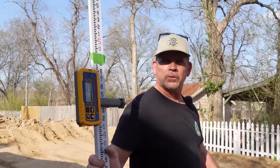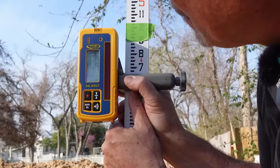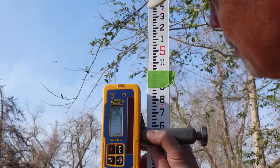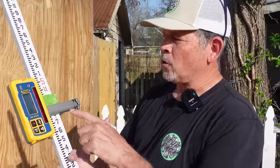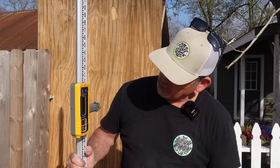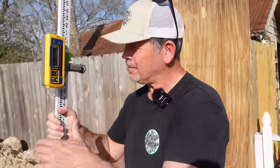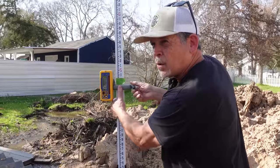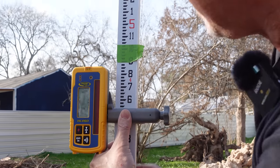Front right corner: about three and a half inches higher. Back corner: I always reset to my benchmark with the frog tape so I know I'm right with the laser at the sidewalk level. This back corner comes out at zero — it's even with the sidewalk. Last corner: lowering down... right there, three and a half inches, just like the other front corner. Not bad.